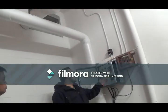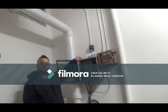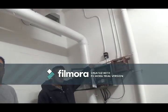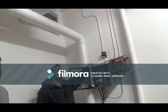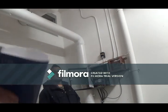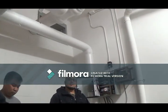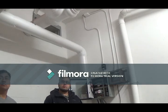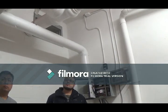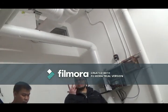Fair enough. So is it a fair assessment to say that when they clean the parking garage, the pits get cleaned as well at the same time? Well, yeah, the catch basin is supposed to collect most of it, but if it does pass through, it ends up in there. The reason I'm asking is that in some instances the silica from the concrete gets down to the pit. They use these pumps to pump the pits out, and yet a month later I lose seals, because that silica eats away at the seals in the pumps. They're ceramic seals, so the debris wears and tears them.